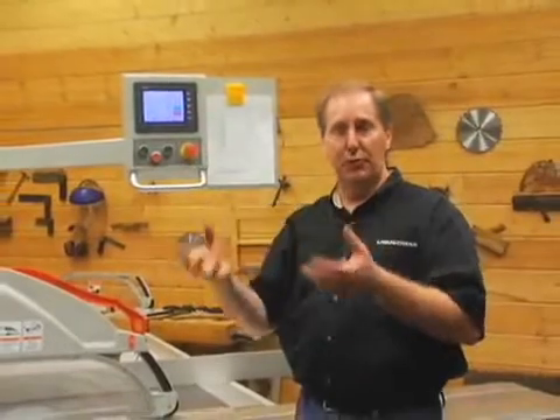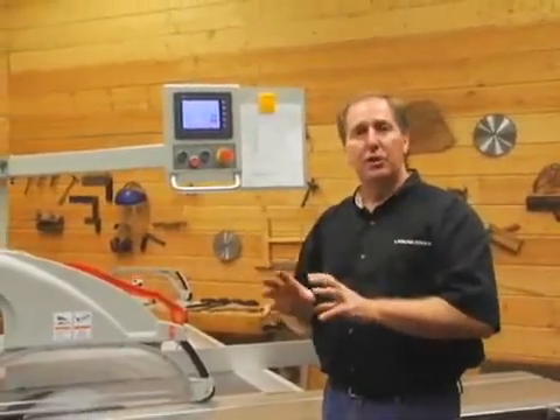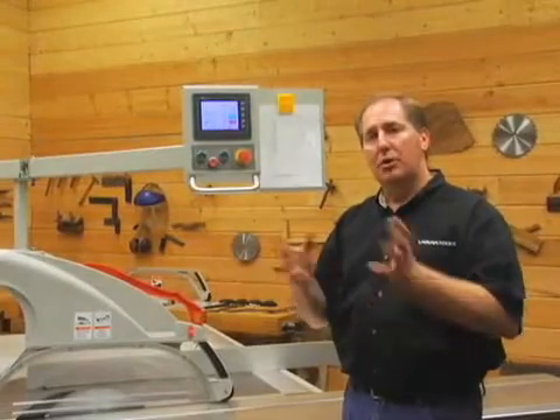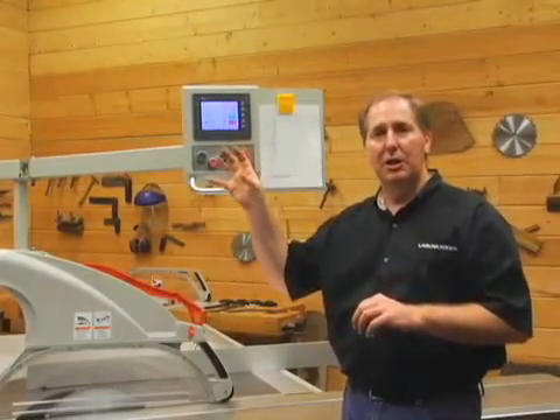There are several operating modes. In manual mode, you touch the blade button and press plus or minus to move the blade. In short-term memory mode, you set memory for a few cuts, do those cuts, and when you shut the machine off the settings are lost. The third mode is hard memory, which stores settings into the machine's memory bank — there are 300 locations, so you can store up to 300 different cuts.